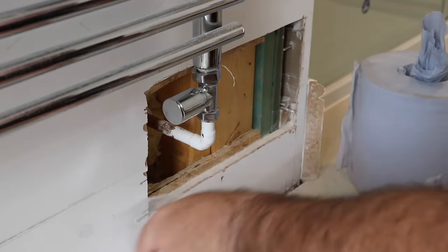You may have noticed I'm going for soldered connections — that wasn't my original intention. I was going to use push-fit because they're quick and easy, but they are quite chunky. Because I'm taking timber away and everything's a little bit tight, push-fit fittings would make cutting the timber out a lot harder. So I've decided to go for something slim and cheap and cheerful — soldered it is.